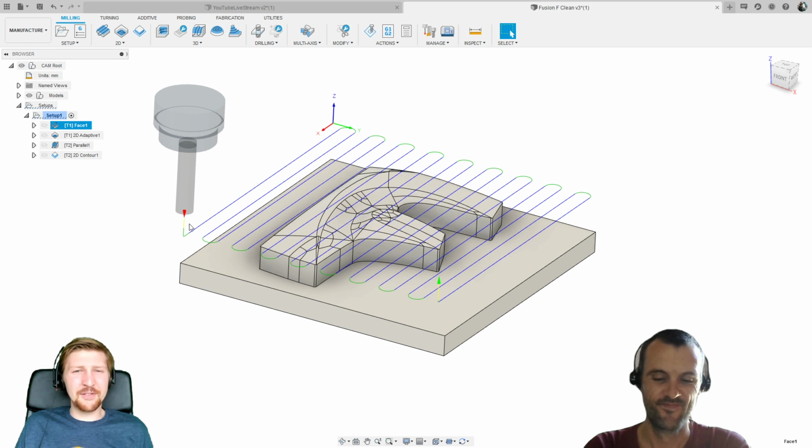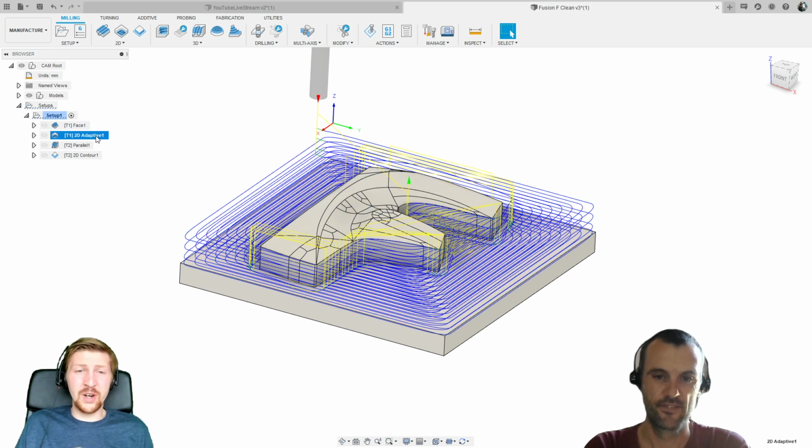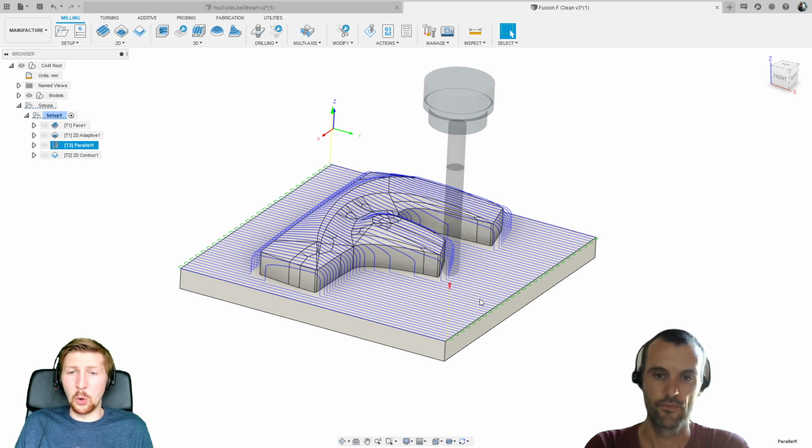So yeah, we've got a basic facing toolpath on here. We then do what we call a roughing toolpath. So really heavy cuts, not very much definition, but let's get rid of as much material as quickly as we can. That's what roughing is. We've then got a finishing cut, which we're using a ball-nosed tool. The tool's got a complete radius on the end as a ball, and that's really nice for finishing because it can create nice curved surfaces.